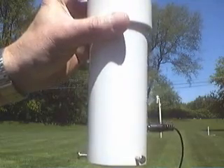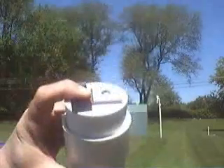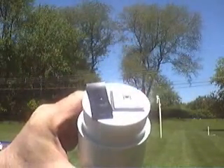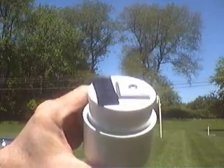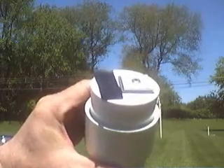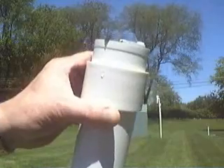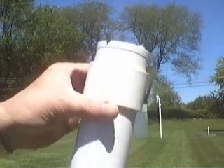Now to simulate it going daylight and giving you an alarm, I'm going to take my finger off of the photocell. Now the light is penetrating right through there, through the electrical tape that's on it. There's another mode of operation — going light or going cloudy — and it'll give you an alarm.